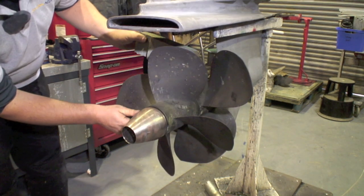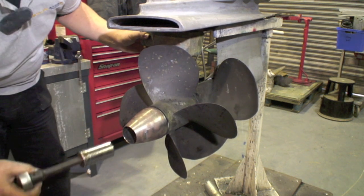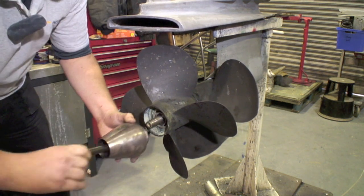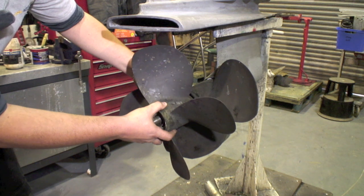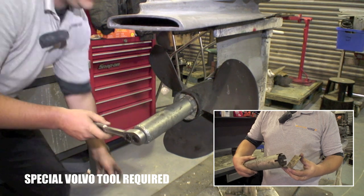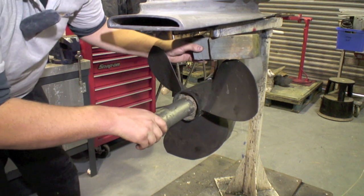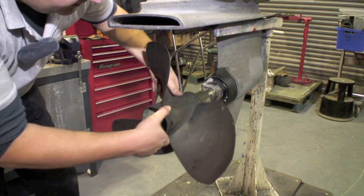To inspect the seals you first need to remove the propellers. Removing propellers from a Volvo DPH drive: put a block under the rear propeller and undo the nut and the cone. Take the nut and cone off — the propeller's on a helical spline, so as you pull it away give it a twist to remove the forward propeller. Put a block between the blade and the cavitation plate to stop it turning. Give the propeller a little twist on the way out.